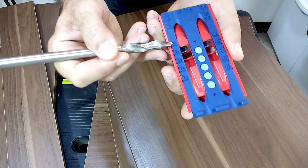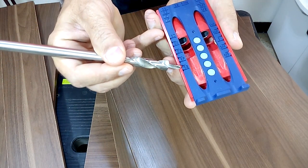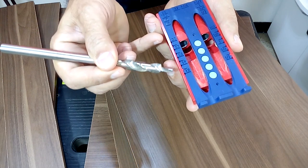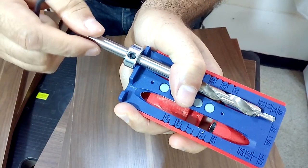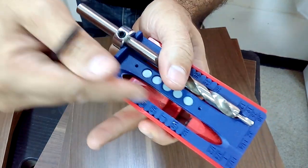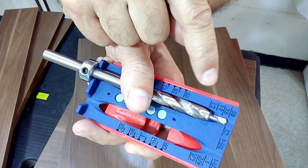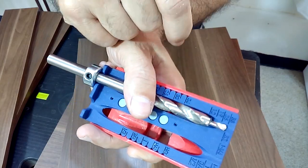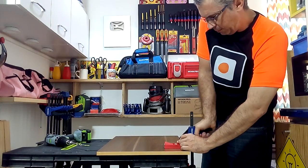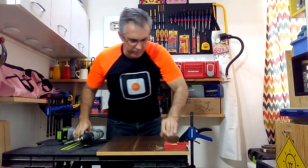Here we can see that this jig has the scale in mm and inches to make the adjustment. We must adjust the template with the small arrow on the line between 12 and 19 because we are going to use 15mm thick melamine. Adjusting the depth stop on the bit is very easy — we just have to place the drill so that the thickness change step at the tip is in the middle between 19 and 12mm, so that it can work perfectly with 15mm melamine.